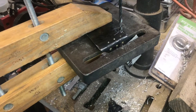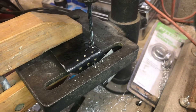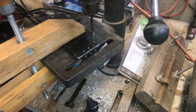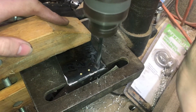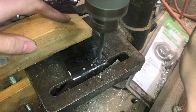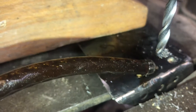When you're drilling spring steel you'll probably run into the problem of hardness again, because the spring steel will be either harder or just as hard as your drill bits if you're using high-speed steel. This piece is annealed, so it's a little bit softer and I found that the drill bits do go through if you go slowly. When cutting hard materials, lubrication is always a good idea.